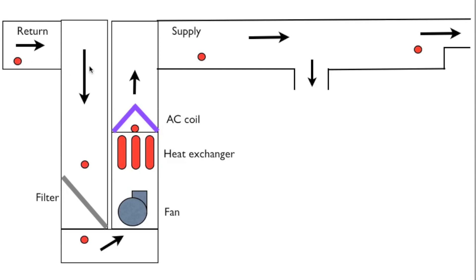These little dots here are places where I'm going to take pressures. If I took a pressure reading very close to the return air grille, I would probably get a very low negative number. Further along, the negative number would be higher because we went around a corner and have friction with the duct walls. Through the filter, I'm going to have more drop due to friction. Every time I increase the resistance, I reduce the air.